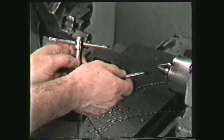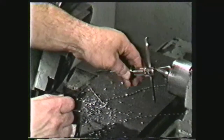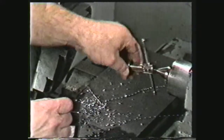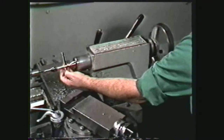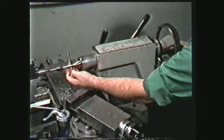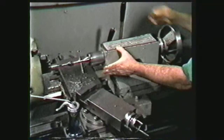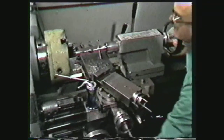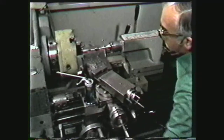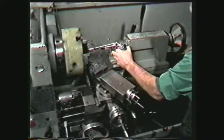Small taps may not have a center hole and are normally used with a T-handle tap wrench since it is equipped with a center hole to give alignment. Extend the tail stock spindle slightly by cranking the wheel and then lock the tail stock in place. Provide clearance for the tap wrench over the ways of the lathe by moving the compound toward the headstock.